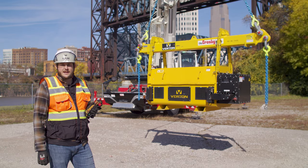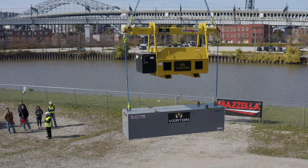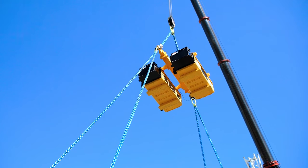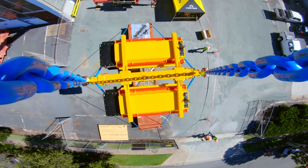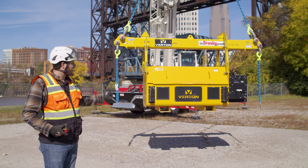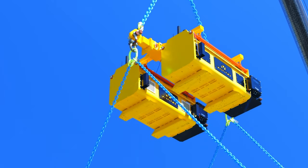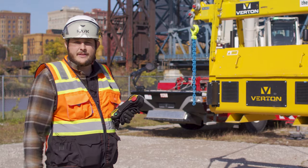These units can control upwards of 25 tons. This assembly right here is roughly 3,800 pounds, so adding that into your pick plan — knowing how much weight you have below your hook — is incorporated into your pick plan and design. If your load is getting upwards of 25 tons, this unit is modular, which means you can add multiple units to your spreader bar. You can attach two of the 7.5s up to six units total. There is also a larger unit, the SpinPod 30, which has four times the capacity of the 7.5. Depending on your application, it might make more sense to use multiple 7.5s, but you need to consider the size of the load as a factor when scaling and picking the units.